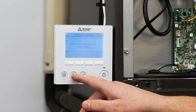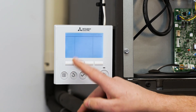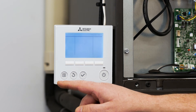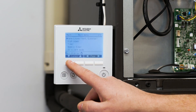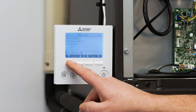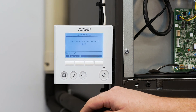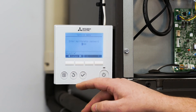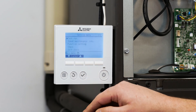From the main menu we're going to set the request code to change the time delay that enables the electric heat from 24 minutes to 11 minutes. We're going to press the menu button, cursor down until we get to the service menu. Once the arrow is at service, hit the check mark to enter the service menu. We're going to enter the passcode as 999 and hit check to enter.